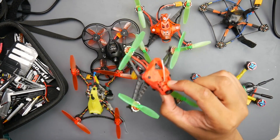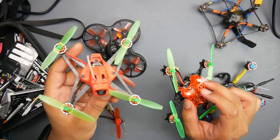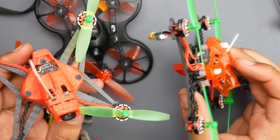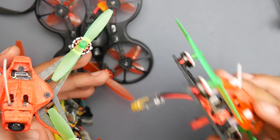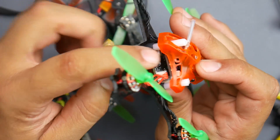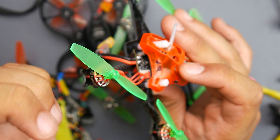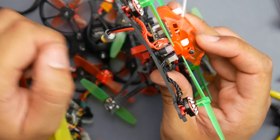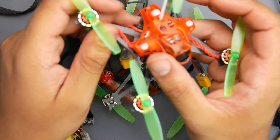The Sailfly X is one of the cheapest here along with the Red Devil, but the quality control on the Sailfly Happy Model is much better than the Red Devil in my opinion. They fly about the same, but I did burn the VTX on the Red Devil. The battery lead connector was sticking up much longer than it should be, and the board comes pre-installed upside down — so it's about half a millimeter from the carbon fiber. Being a little rough, I plugged it in and it just didn't want to boot anymore.